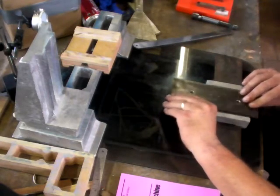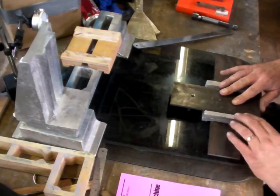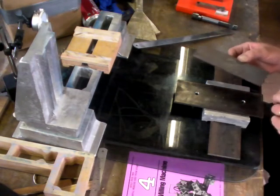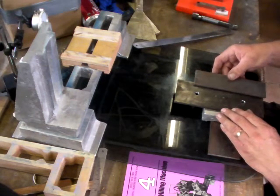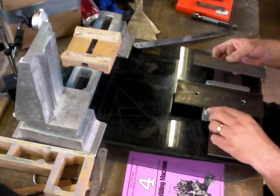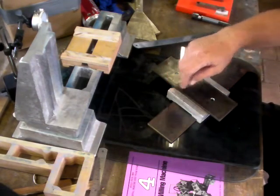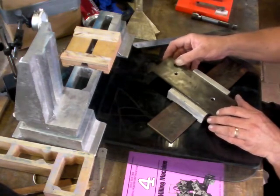You notice it's marginally lower than the thickness of the ways plate. That allows then for another one by a quarter — not two by a quarter — to go over the top, and then the adjustment of the ways is with shims on these surfaces. And then there's a gib that gets fitted in there with three or four gib screws to provide adjustment on the ways.